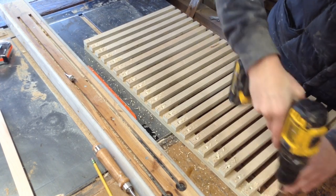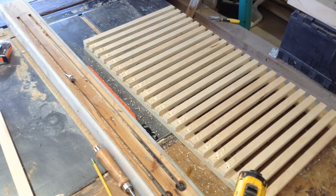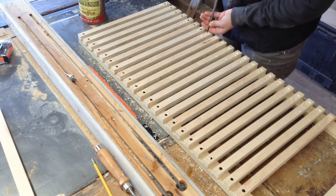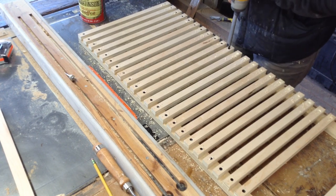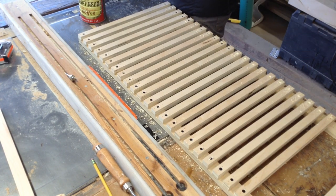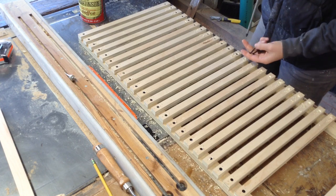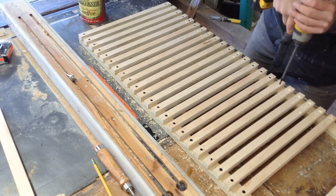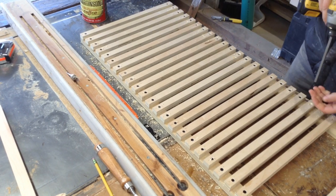This one works, but there are ways I would have done it differently. I went through and added screws, which I'll probably eventually take out, but I wanted to use it right away. It's wintertime, so the glue is going to dry very slowly. In order to be able to use it right away, I just put some screws in it and then I could go to town on that cherry.